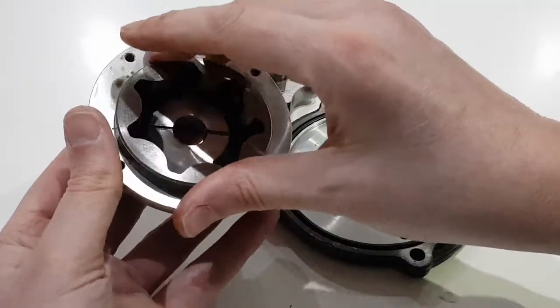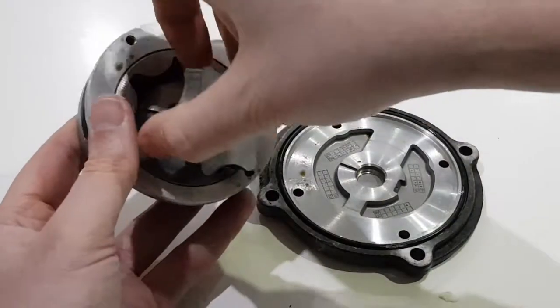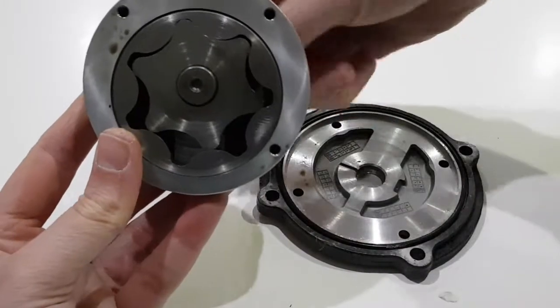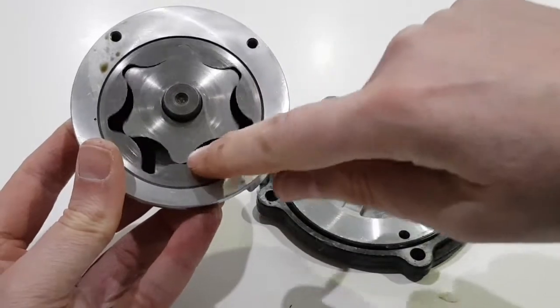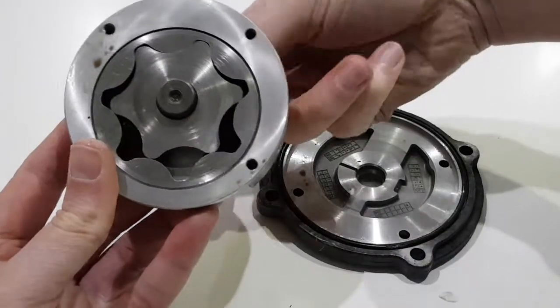When the gears are in place, when it's mounted on banks four to six, it's rotating in this direction and this volume gets trapped between the gears and is moved from this side to this side.